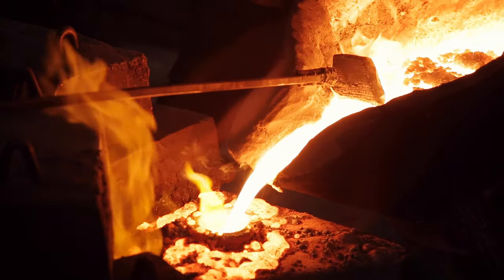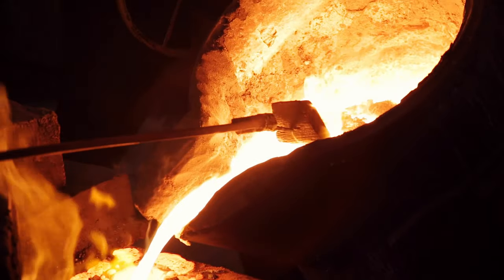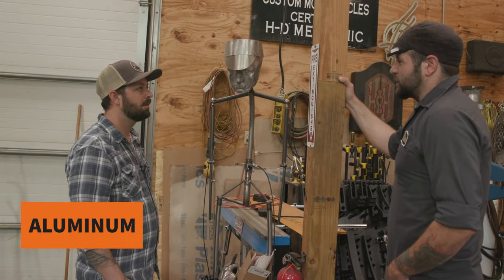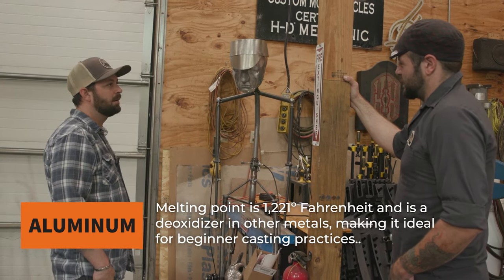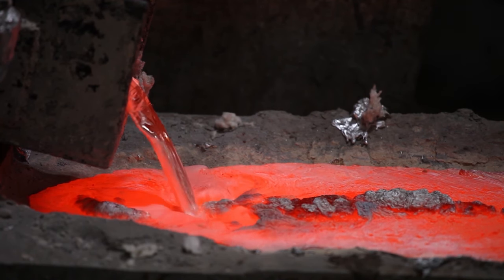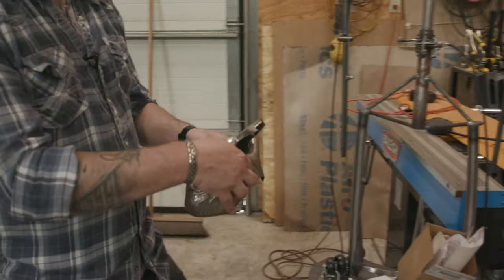When you're melting down metal, it's easy to get impurities in there and they float up to the top. How much material are you losing to impurities when you're casting? Not much with aluminum. Aluminum is really good for that — you don't even have to put flux in it. It's not like casting bronze. When you're doing aluminum, you're just scraping the impurities off the top; they float right to the surface of the crucible. Once you've got it nice and liquid, you just take a spoon and scrape the surface. Aluminum is very forgiving when it comes to casting.